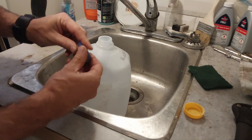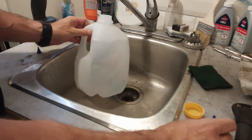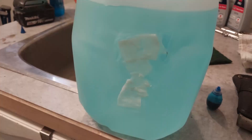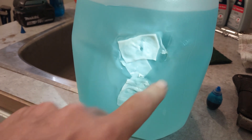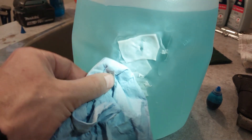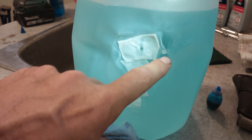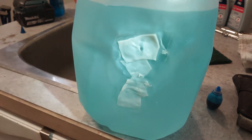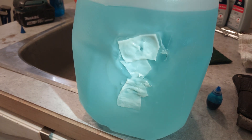Time for the test. I'll put a couple more drops of blue food coloring in so the water level shows up a little better on camera. Taking a closer look at the patch — right there and at this corner, two small drips are coming out. The majority of this patch has worked great. It looks like I got a little too thin in one spot and this corner maybe wasn't quite hot enough when it stuck. The beauty of working with HDPE: I can just dump the water out, heat it back up, warm those pieces, put a little more pressure on it, and the leak will be fixed.